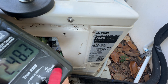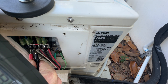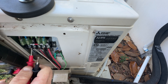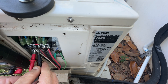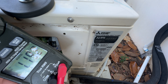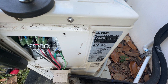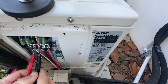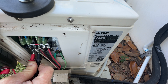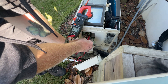I'm getting 248 at the cables, which is good. Then you're going to do the same thing to S1 and S2 — coming out of the board, 248, so the board is giving power coming out. Then go to DC voltage and check between S2 and S3. You should be getting between 12 and 24 volts — I'm getting one volt. I just swapped the thermostat so it's calling for cool mode, and I want to stay here and wait for this thing to kick on to see if we're getting communicating voltage.